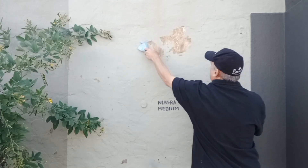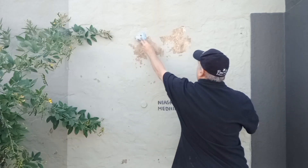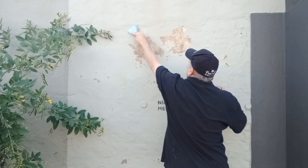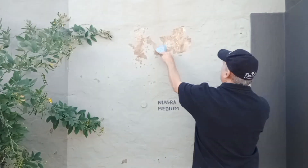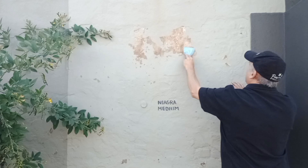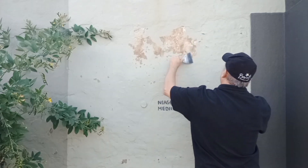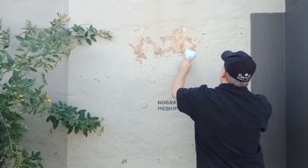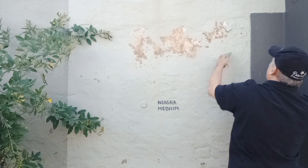I've done an investigation. Other than it being a boundary wall, which are maintenance walls — you've got to maintain because they don't have a damp course. I'm scraping all the paint off, and this time I'm going to apply a cementitious slurry, a waterproofing cementitious slurry, to give us a better chance of success and paint not peeling away like it is now. So I'm getting off all that looseness first using Hamilton's Utility Scraper.